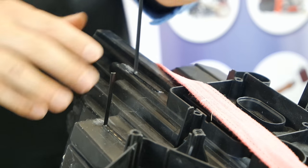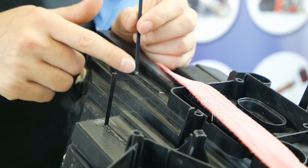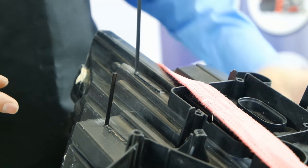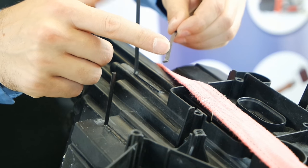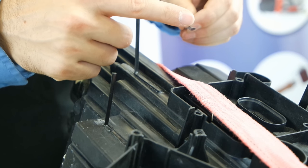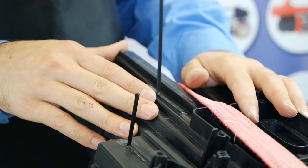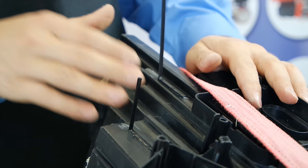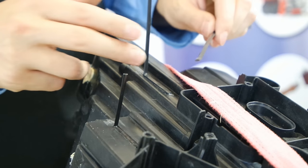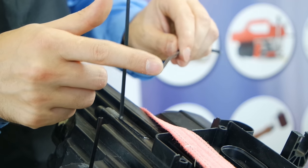With the PPU material, as you have noticed, the temperature is a bit higher than with pure PP, but not as high as PPGF. It is between the fiberglass binder and the PP binder when it comes to temperature. In this case, when there are additions in the material, it is recommended to use PPU and not pure PP. And even for those who are not very experienced in welding, use PPGF and not PPU, as it is easier in welding.